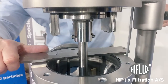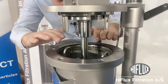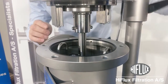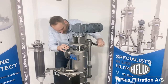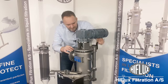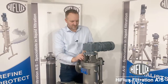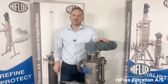Lift it a little bit up to release the tool. Now make sure that the handles are not under the blocks. This one is closed, the O-ring is here, and the scraper looks good. Close the filter, then put in the bolts and tighten them from one corner to the other corner. Now you are ready to use your filter.